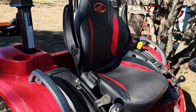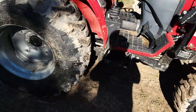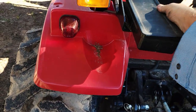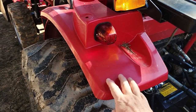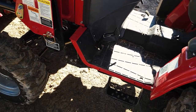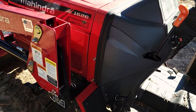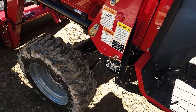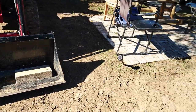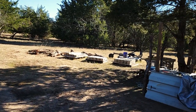I am so pleased with these Mahindras. There are a lot of good features in them — the armrests come all the way down, which not all small tractors have. The weight alone, the 26 horsepower, the hydraulics on it are just stellar. The toolbox in the back's kind of chintzy — I'm going to pull it off and put my own on. Plastic fenders — I'm not a real fan of that, that's the only plastic on it. It's just four-wheel drive. I did not get the hydrostatic transmission because I know I'm going to be out in fields and I don't need a lot of back and forth, and I didn't want the complexity. Get forks when you get a tractor — a bucket isn't enough. I use the forks more often than the bucket, to be honest. And then backhoe — I've got a backhoe back in there. Good farm equipment will be necessary. That's tip number seven.